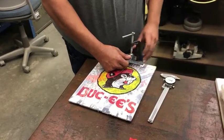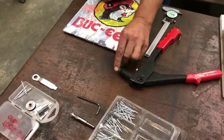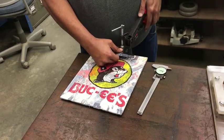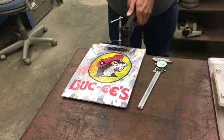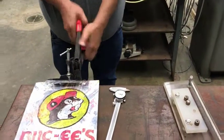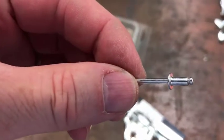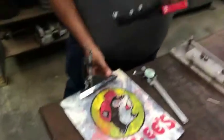We're going to line it up there and hang it over the edge. These blind rivets — that's the generic name, or pop rivets — you push them in there, and then you push down and squeeze it. That pulls the center pin up, and at some point it will break off. Here is a pop rivet. There it goes. There's one that looks closer up — the center mandrel, it's called — it pulls that up inside there as it squeezes it.